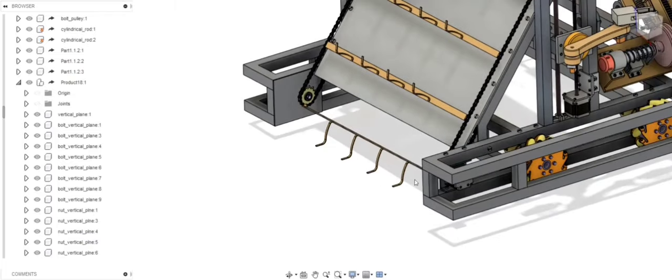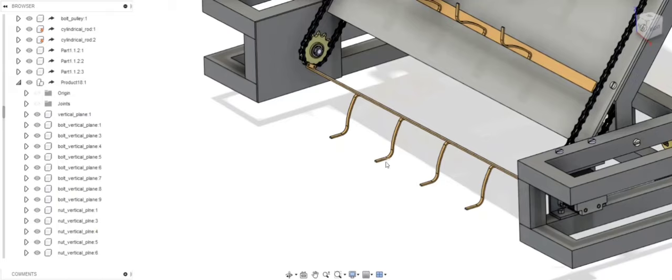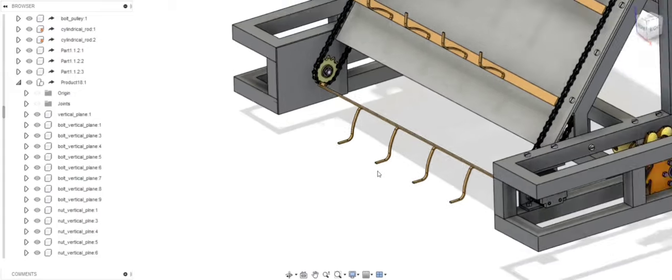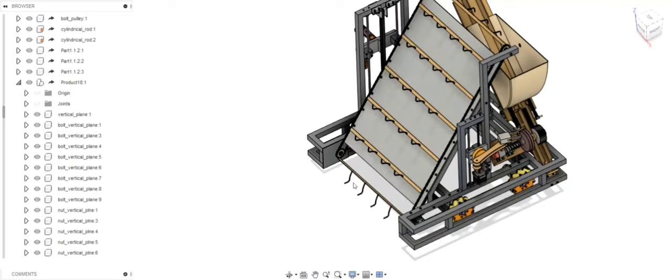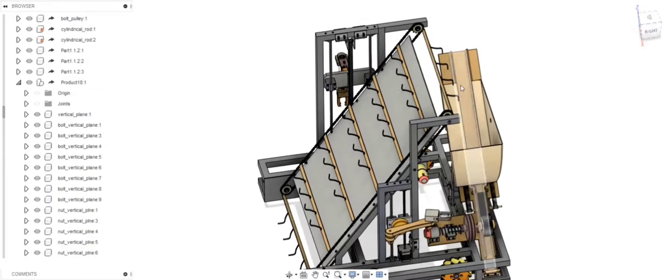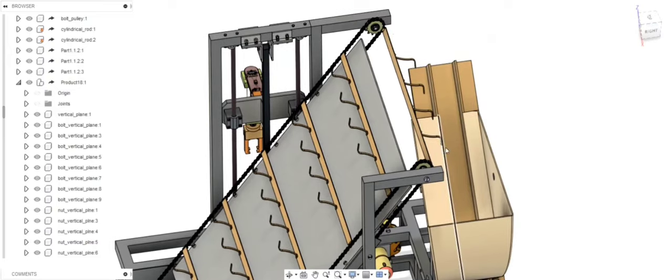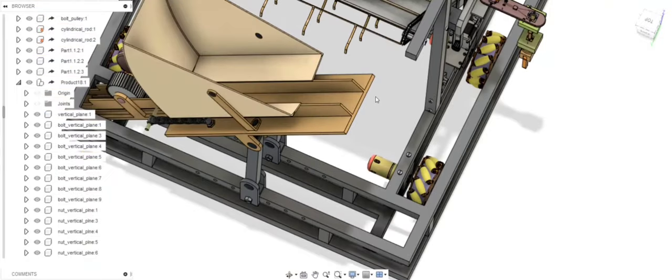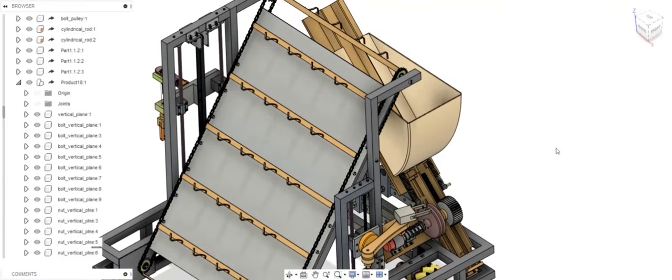This hook arrangement is designed such that the tip of the hook just grazes the ground. We align the robot so that the hook arrangement can pass through the narrow gap between the arrow body lying on the ground and the ground. The hooks pick up the arrow and, by rotating the sprocket, the picked-up arrow is moved upward to the top position, where the hooks turn and throw the arrow into a funnel-like structure. The arrow slides down the funnel walls and falls into the shooting slot.